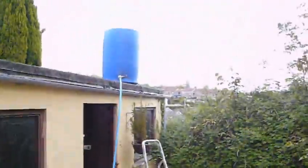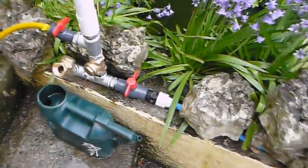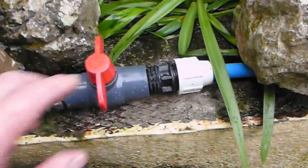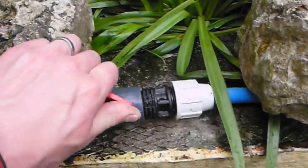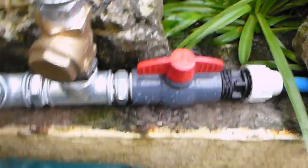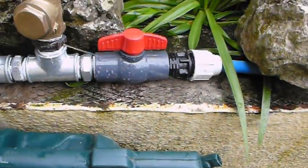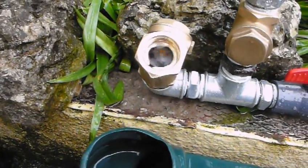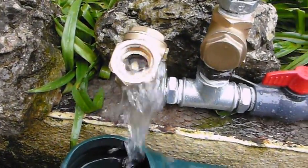The water's switched on on the drum up there. I'm going to switch it on here now on the pump itself. Keep the outlet switched off and we build pressure up. Let's turn it on. There we go — the pump has started pumping. As you can see there's a swing check valve there being shut.